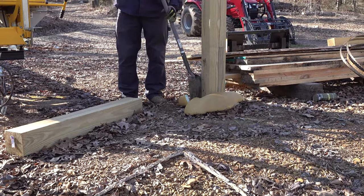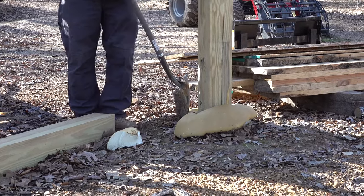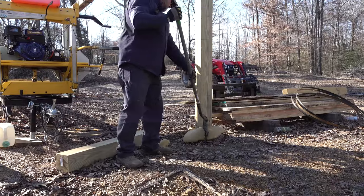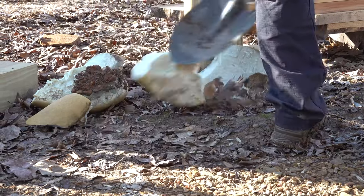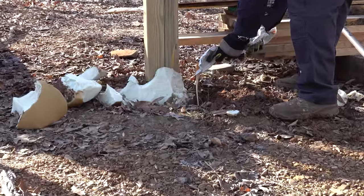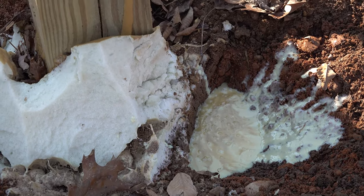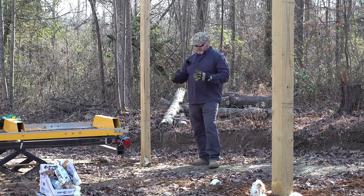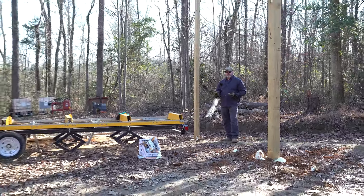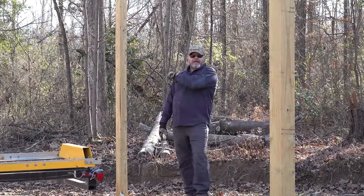I'm going to do that one fast too. You got to use a saw to get it off - that stuff's tough. Now we've got the foam put into all the excess voids around these posts. We'll let this wait for 30 minutes. Fast 2K is safe to start working with after 30 minutes, so we'll wait and show you guys the results.